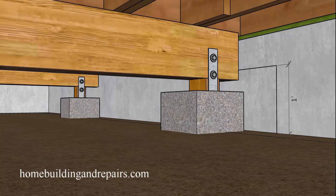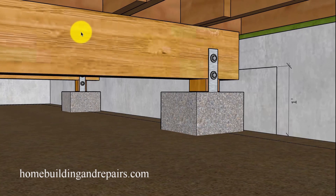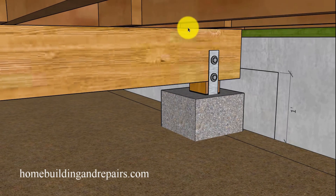The last example in the video will provide you with an illustration of what I'm actually talking about when installing a larger girder beam. For example, if you had a four by eight and already had the minimum 12-inch or even 13-inch clearance, and you install a board that's two inches larger — a four by ten — that is going to create a problem for your building inspector and local building code. This is the main reason I made the video: to point out that there are other options instead of installing larger girder beams and reducing that clearance distance.